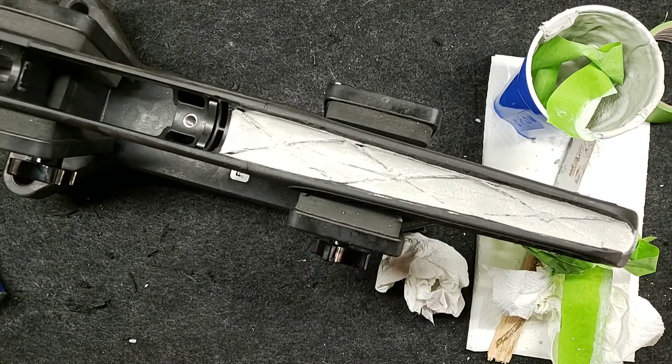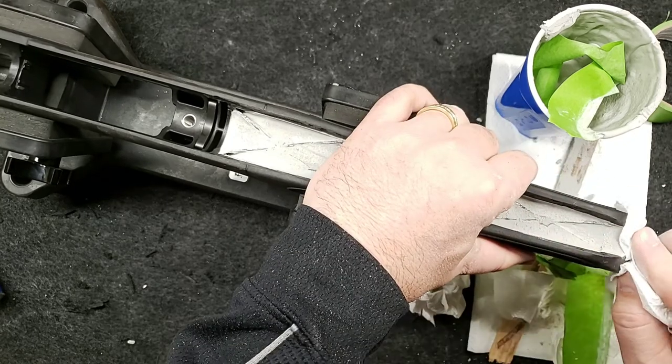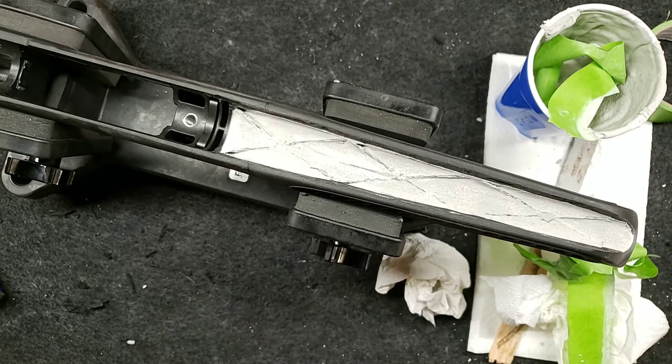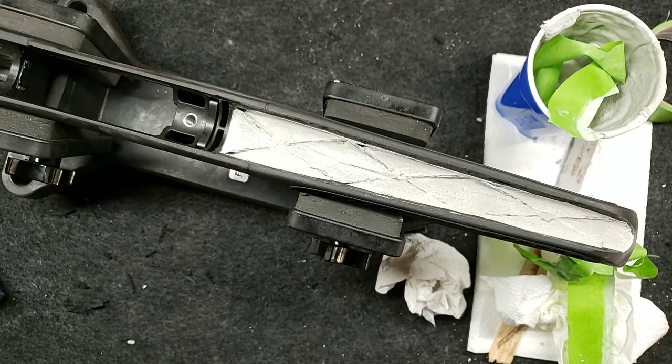I blew out all the crumbs and we're just going to let that set up like that. I'm going to use a little water here just on the front — we might not even need to do that. Right now I feel pretty good about this, mainly because I could see the Rockite moving through those holes I drilled between the baffles, and I think we're going to be glad we did that. My fear was that this would turn into like an ice cube tray and under recoil they might pop out. Just an extra step — I don't even know if it was necessary. We'll let this set up and dry; I think I read four to six hours, then we'll come back and start working on bedding the back section. Stay tuned.